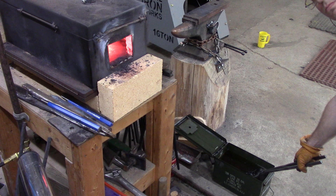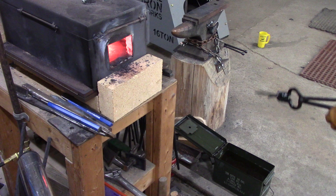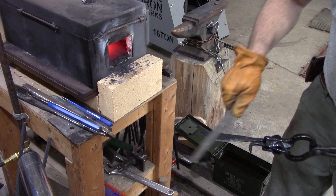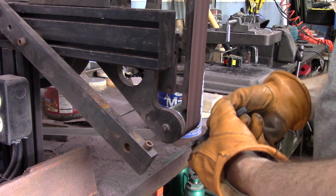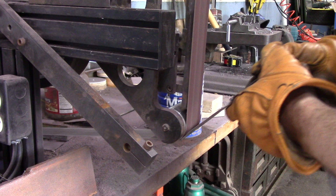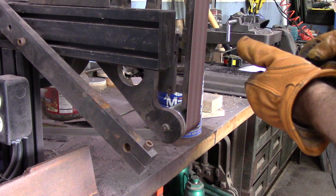I actually normalized it twice and didn't film those. That's pretty much just heating it up above the transition temperature and letting it cool down until it's not glowing anymore. It turned out fairly straight and hard in the blade, just as I expected — it was a really easy steel to heat treat. Some steels take very precise temperatures and time changes, but this stuff is just get it above non-magnetic a little bit and throw it in some vegetable oil, and it hardened right up.